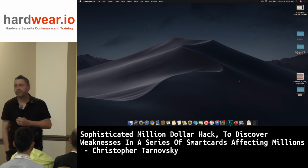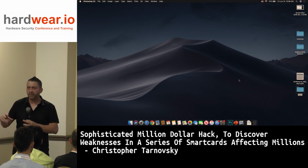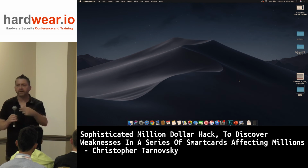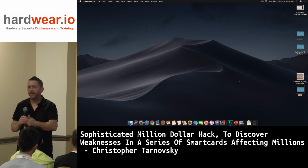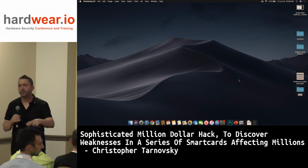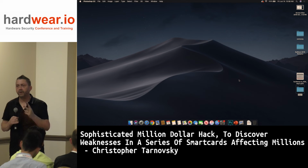I use FPGAs every day. That's how I stimulate these chips that I work on, with a custom FPGA board that I designed with my dad. It generates a clock to the chip, and it has I2C, and it has SPI bus, and it has ISO 7816 UART. It's got everything. I use this FPGA board to talk to the chip as well as to capture my data. It has 2 large static RAMs.